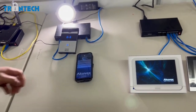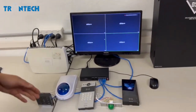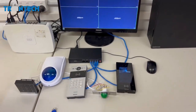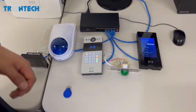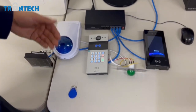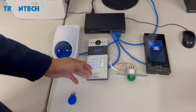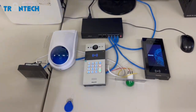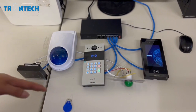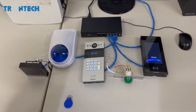Apart from automations, you can also use the door station as a standalone access control unit. I've got a basic setup here using a strobe to replicate a striker, so when it triggers you can see the light flashing. I've got a door station with a striker and an exit button connected. I can open the latch, and I'm also able to add a secondary keypad or card reader to the door unit.